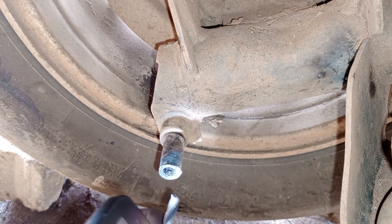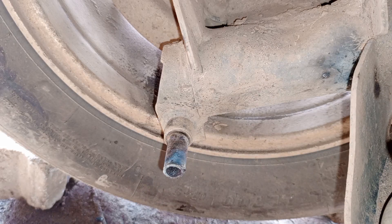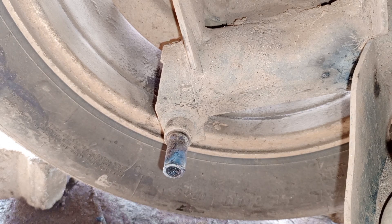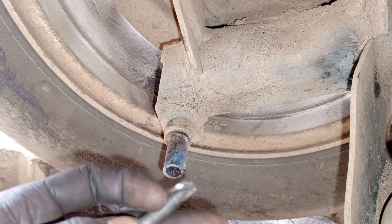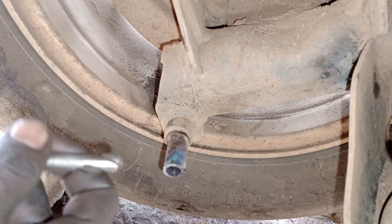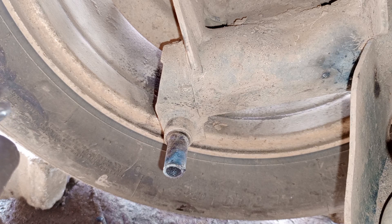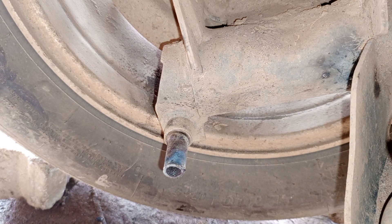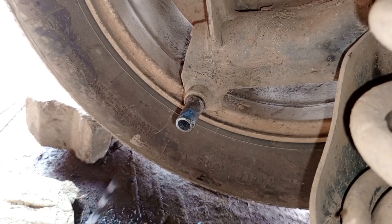You also need a small torch. Let's try again to drill in. This time, those remaining pieces we've been knocking are a bit stuck inside. To remove them, don't use the eight millimeter drilling bit again — if you use it, you may end up destroying the threads inside. Use a smaller bit. I'm going to use seven millimeters. You can use seven and below, but don't put in the eight millimeter drilling bit again.